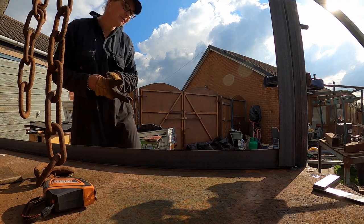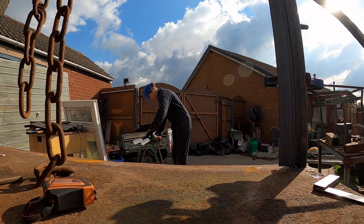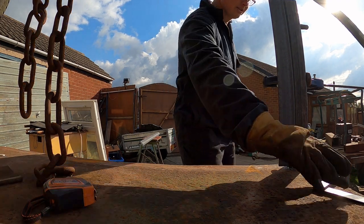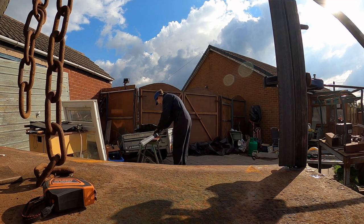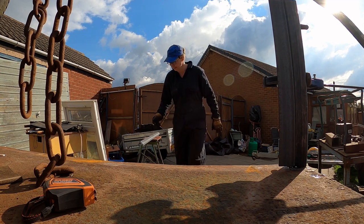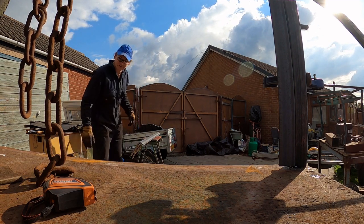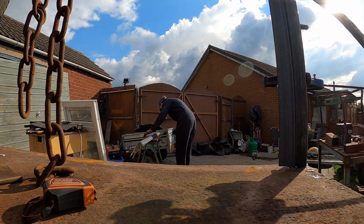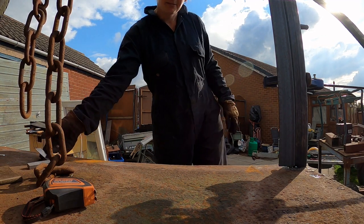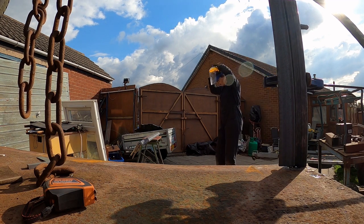So I'll cut the other one the same length now, while I've got the square edge. So I'll use this one as a template. So I'll just use my square to get the angle out, like so. Get the mole grip so it doesn't move. Check the end again. Yep, the end's good, so we can now just cut down the edge of that, and that will be the same. Hopefully, it'll also fit in the back. Hopefully. In which case, I could do all four in one day.